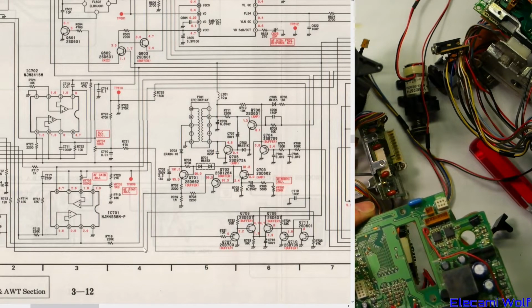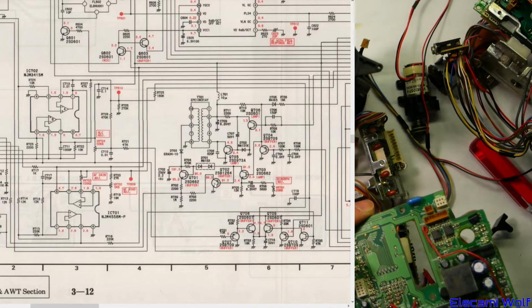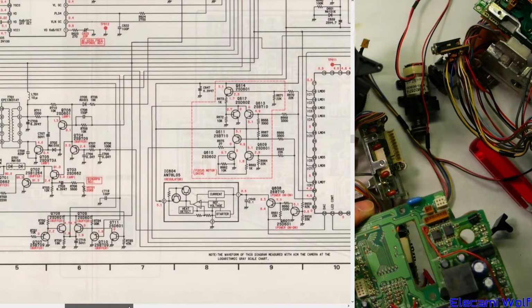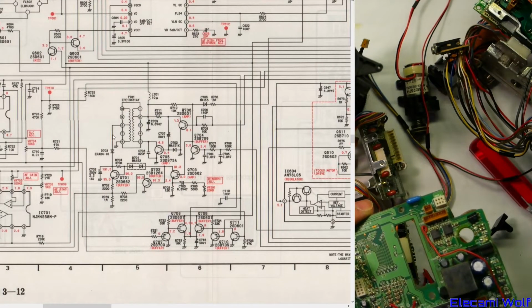Okay, so the signal is through here, off here. Oh, I see. There's a push-pull kind of buffer thing there, and then the signal must be this one here, which comes from some circuit that's telling you what to do. Digital to analog converter. Okay. So some variable voltage will be coming out of there, and then that gets amplified up to a fairly high voltage from this power supply rectifier smoothing capacitor there. There'll be a fairly high voltage on that point that then gets proportionally applied to the piezo disc through that transistor, and then current drawn off of it through this transistor. So there's a push-pull type thing, like a little audio amplifier circuit. And then there's some biasing adjustments. So that's powered from this, and then switched through that.